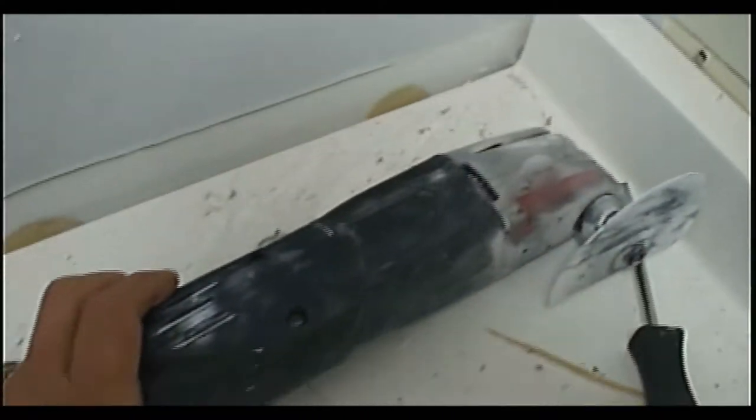Okay, you too come back. This is what we got so far. I cut out a piece a little bit bigger than what the hole was, then I set this piece on over top of it, marked it, and cut out the wall so it would fit in there. I put two pieces of wood back behind there to hold this on. This is what I used to cut it with. We got the medicine chest down. I put my name there, ten years later. So this is what we're looking at so far — we're getting there. I gotta let this dry, then I'll put another coat on it, and I'll probably go with three coats. And I didn't put the tape around it — didn't have to. A nice tight fit, I'm not gonna need the tape.